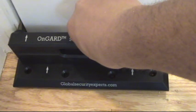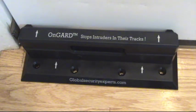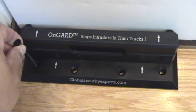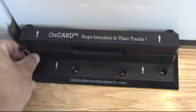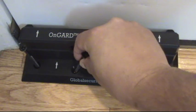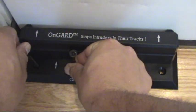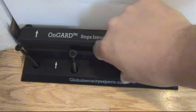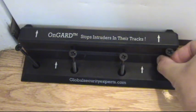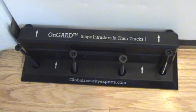Put it back in place and drill through. Once you've drilled your pilot holes, the next thing to do is start your screws by hand — just kind of get them turned in so they're all generally in place and relatively started. Maybe turn them a couple of times with the screw gun. What you don't want to do is get one all the way in, because then you end up with one offset and you have to start all over again. Get them all started.